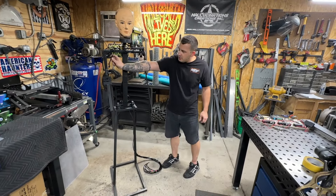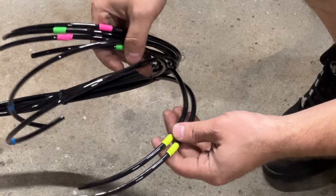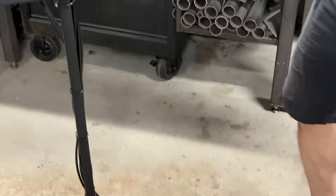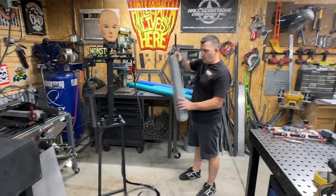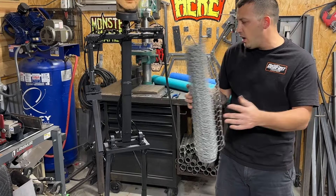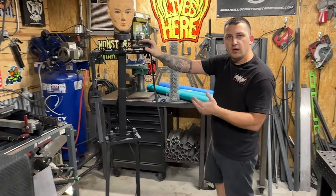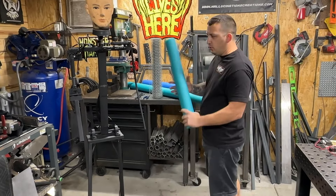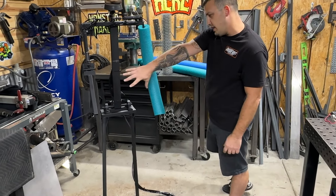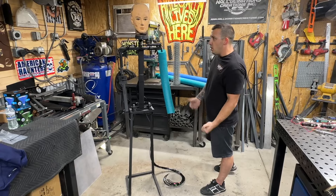We got the mechanism painted up with all cylinders and airlines plumbed. We color-code all the airlines for each cylinder on all our prop mechanisms, making them easy to hook up, test, and diagnose. Next, we're building out the body using chicken wire to form a cage and build up the shoulders — it's lightweight and bulks it out. The weight is kept low so the cylinders don't need much air to move. For the arms and legs we're using pool noodles, giving you a real lightweight, bulked-out arm, while the hands will be foam-filled onto the actual mechanism.